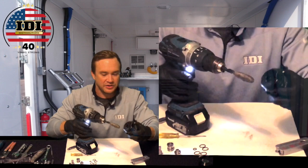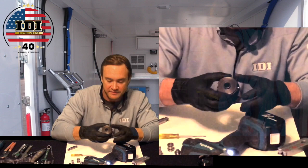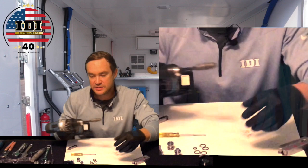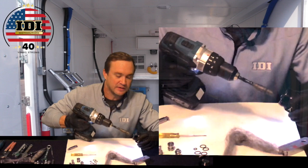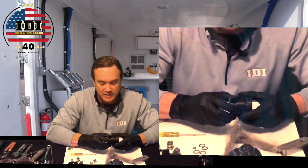All the way through with it. I'll go in the same direction and you can really polish the inside of these chambers. It's really imperative to have a clean surface for these o-rings to seal properly. You can repeat this process with the same piece — you can obviously get more, buy a whole bunch of this steel wool — but you can do this in all of these ports: check valves, all your check valve ports, and even the front hole where the mixing chamber goes. Again, it's imperative to have smooth, polished surfaces in here so the o-rings can make a seal.